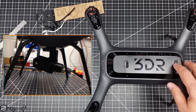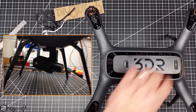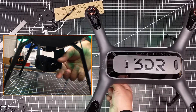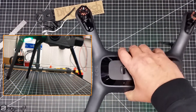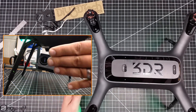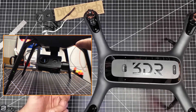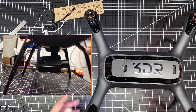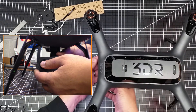Okay, we're back — we have it assembled. I'm going to go ahead and power up the Solo. And there you see the gimbal — hopefully I'm getting this on the iPhone. Now it tends to want to tip up a bit, as you can see in the overlay. I haven't quite figured that out. It's developing a twitch too — I'm going to have to connect this and probably reprogram the Storm 32-bit controller a little bit, because you can see how crazy it's going. I think part of it has to do with the balance of the camera and how it's being driven.